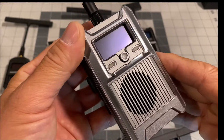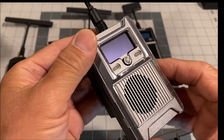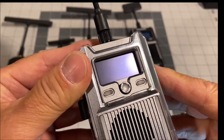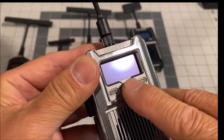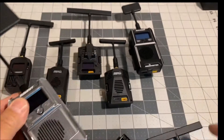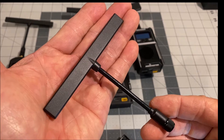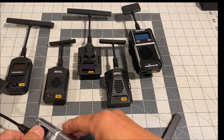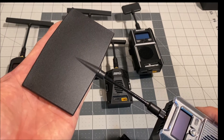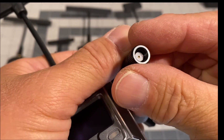First, here we have the Bandit. Its outer casing is made from CNC machined aluminum, which efficiently dissipates heat to maintain optimal operating temperature. It has a high contrast OLED display, a five-direction navigational joystick, and customizable shortcut buttons. It comes with an 80 millimeter T antenna with a 2.7 dBi gain for general multipurpose flying, and an 80 millimeter Moxon directional antenna with a 4.6 dBi gain for long-range applications. Both have the RPSMA connector interface.